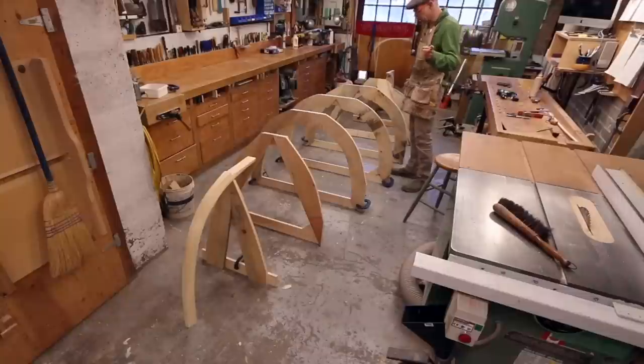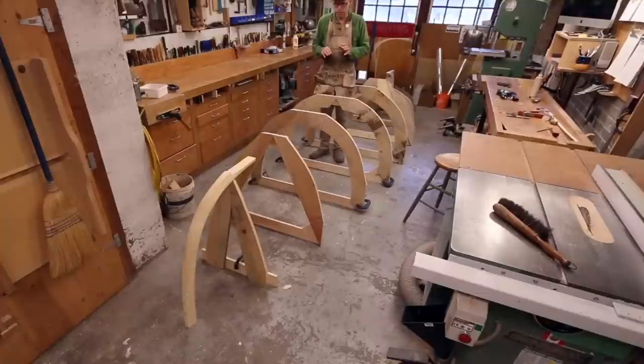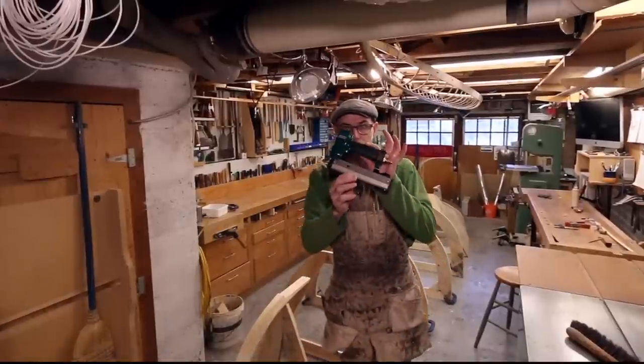If I do it at all it'll be half sheets anyway, which I can scarf right here on my table because this table is 24 inches deep — I made it that way on purpose so that I could scarf half sheets with the mold in place. I should probably think about thicknessing a bunch of stuff and dress down all the stringers — I pre-cut them but they haven't been thicknessed to their finished thickness yet. I might just do that by hand, setting up on the bench here with a jointing plane to make sure they're looking good, get one reference face that's nice and fair, and then the rest will get taken care of in the thickness planer.